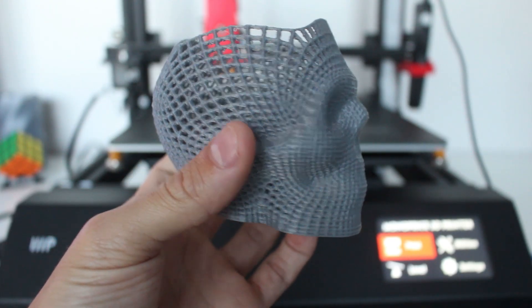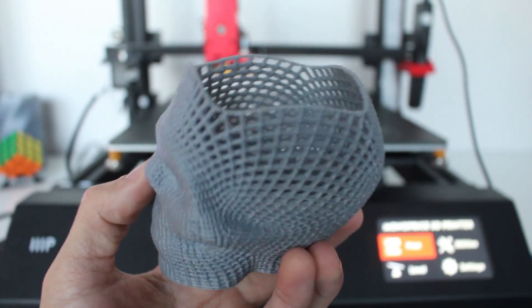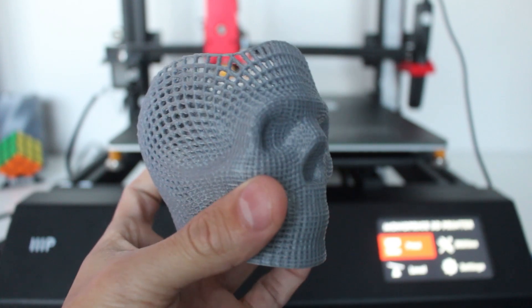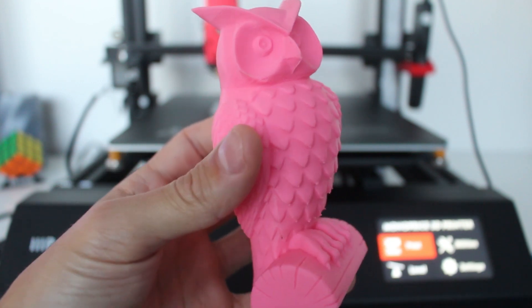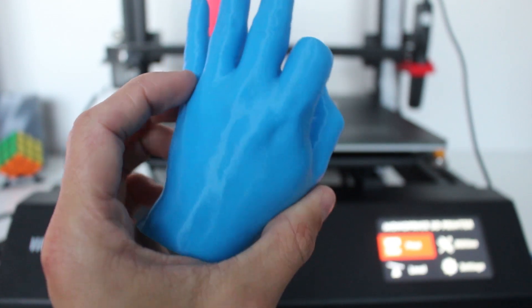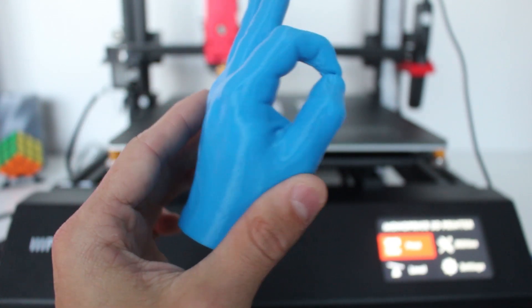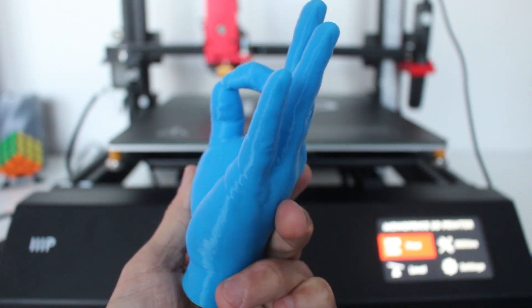Now I just wanted to show you a couple of example prints that I made with this machine. As we can see here, the quality of all these prints came out really nice. These were printed at 0.2mm layer heights. I typically print with the print speeds down pretty slow, because I'd rather get a nice quality print and wait a little bit longer. I find that if you run it just a little bit slower — yeah, it may take an extra hour or two — but the quality of the prints comes out fantastic.